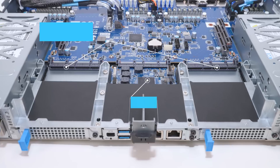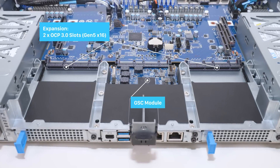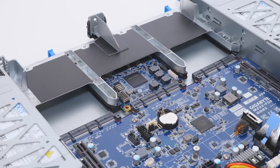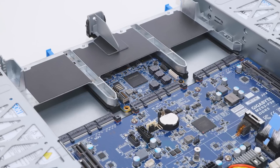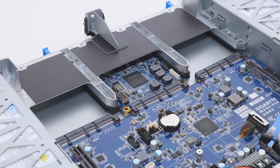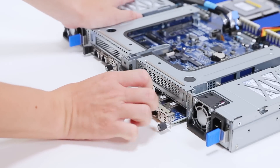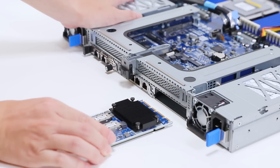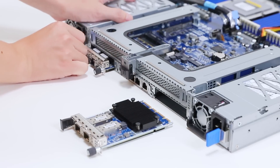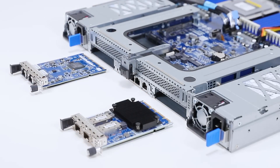There are three connector options on the rear side: two PCIe Gen 5 OCP 3.0 mez cards and a GIGABYTE GSC module. Different from OCP 2.0, OCP 3.0 has evolved from a board-on-board mezzanine to a board-edge format. OCP 2.0 cards have space limitations because of the heat sink, whereas the OCP 3.0 board-edge connection allows easier servicing without needing to open the server, while also taking advantage of the hot plug feature.